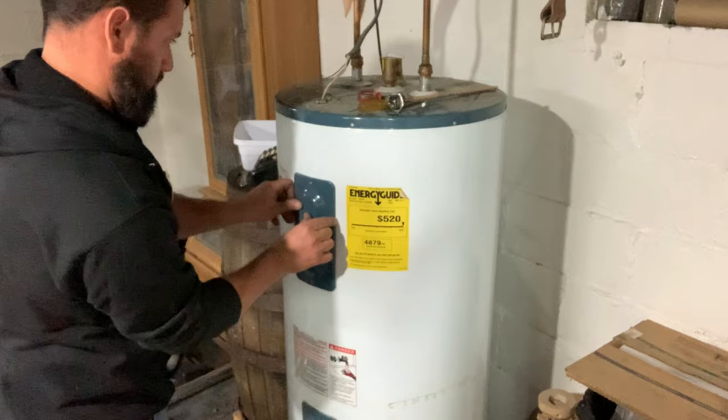That's how you install a hot water heater element. We're going to turn our water on and check for leaks. The packing nut on our hot water valve is leaking - we're going to try to tighten that up; if not, you can get those rebuilt. You can hear it filling and there are no leaks at the element. Once I clean up this big nasty calcium buildup - that brown stuff is all calcium from the well system - I'm going to throw my breaker on and we're going to have hot water. Thanks for watching, please subscribe and hit that like button.